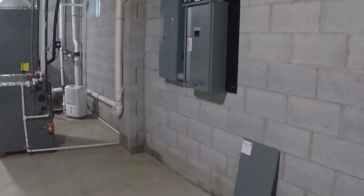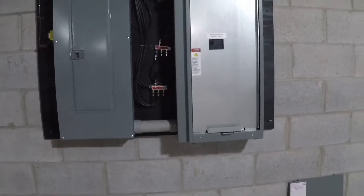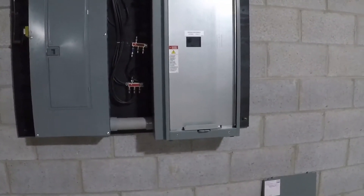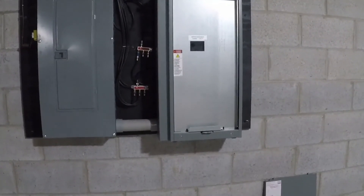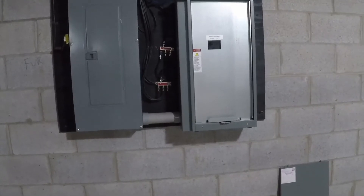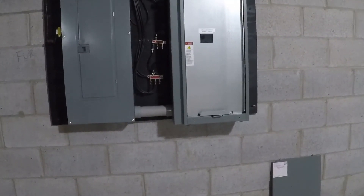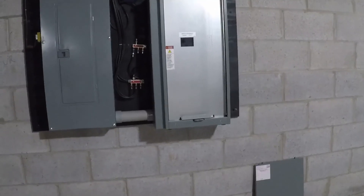Whether I'm home or not home and the power goes out, this does it completely on its own. When the automatic transfer switch goes from emergency backup — which is on right now — back to utility, there is no interruption in power; the lights won't even flicker when the system goes back to normal. You do obviously have that little bit of a power outage when the system first goes off and the generator is waiting its time delay to fire up and settle, but then I also get push notifications to my phone that the generator is running.